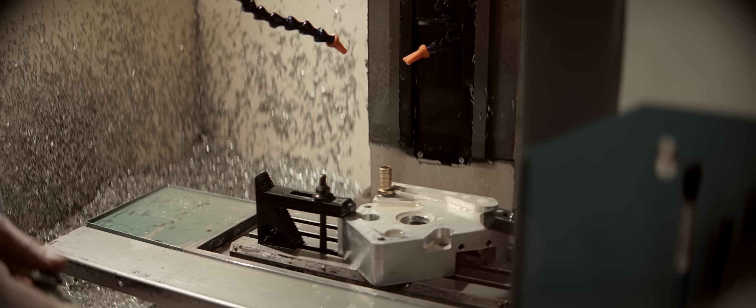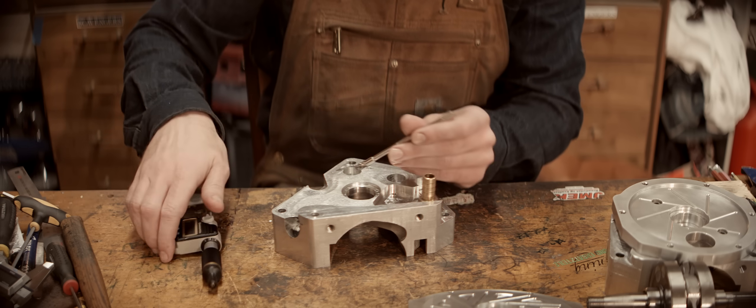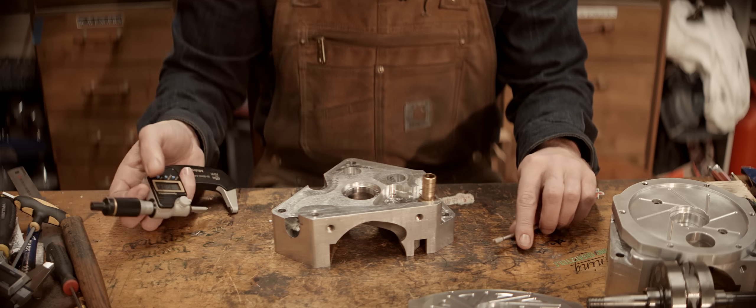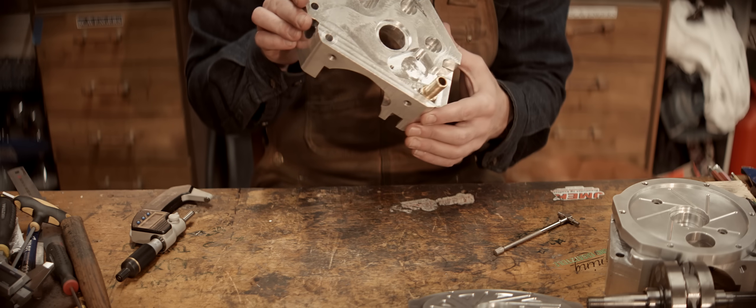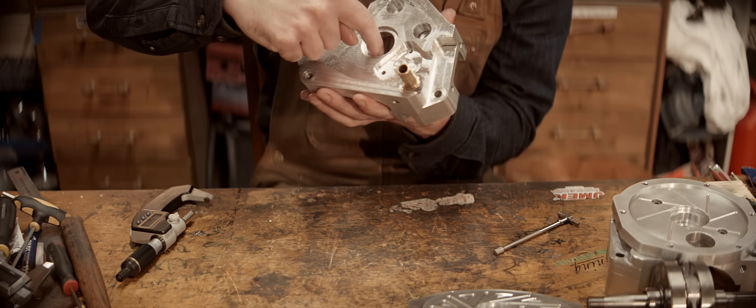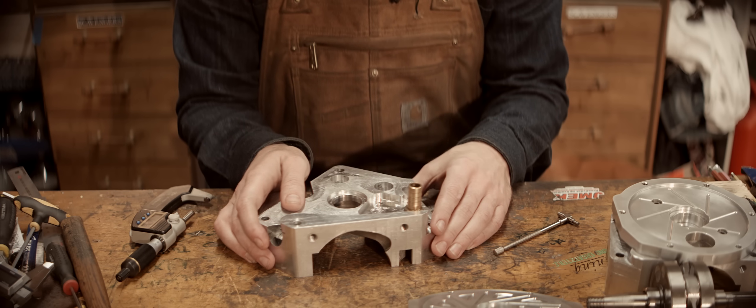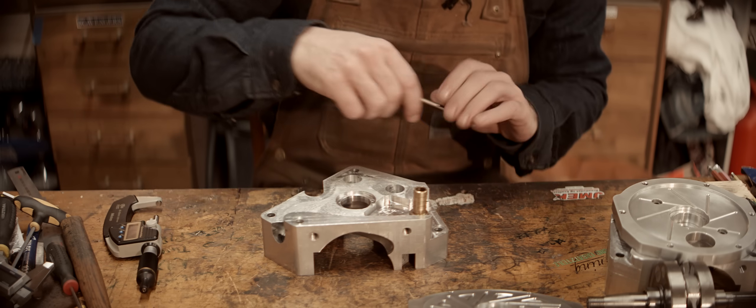30, 30, 30, 32, 31, 32, 32, 32, 33, 33, 32 - pretty much spot on from what I can see now. A little bit bigger in this dimension still, but that's because it was bigger in that dimension. I can see how the tool didn't clean up that area - there's actually a dip there. The surface was touched all the way around except for a spot which is about 0.03 millimeters larger - so within tolerance for that seal now.